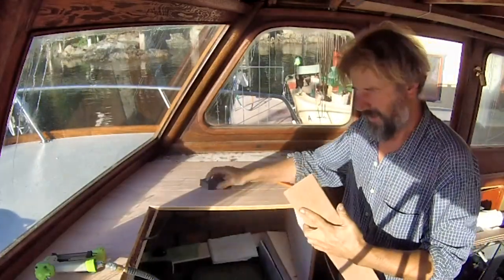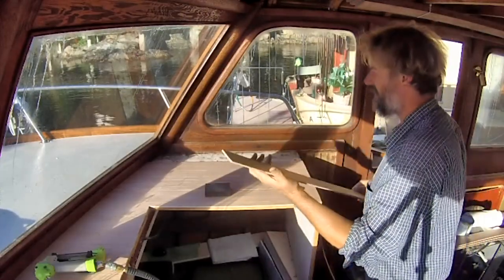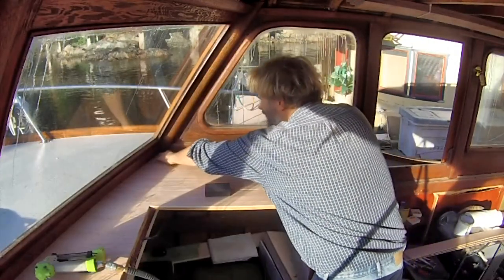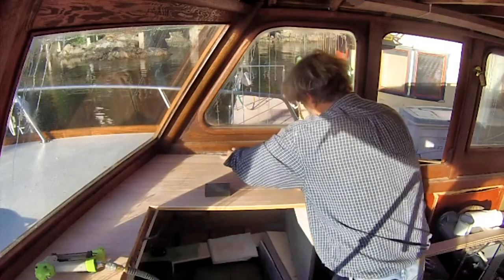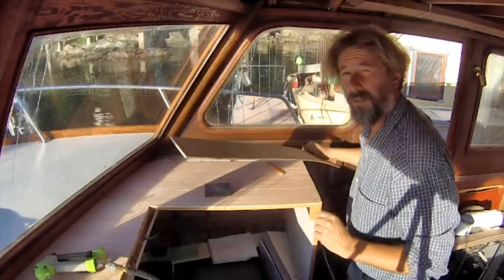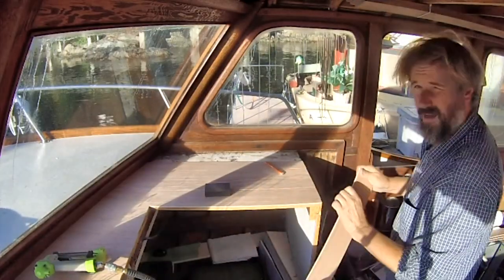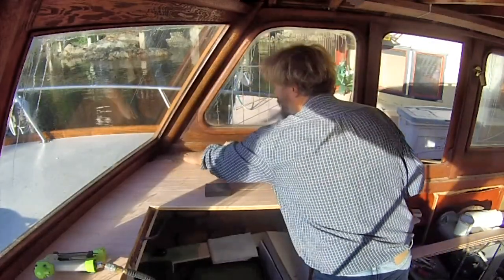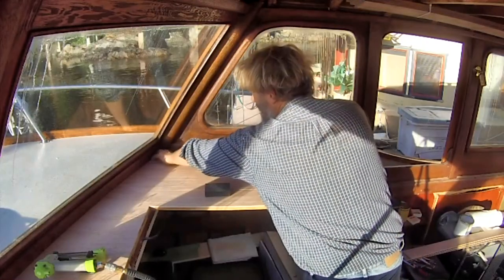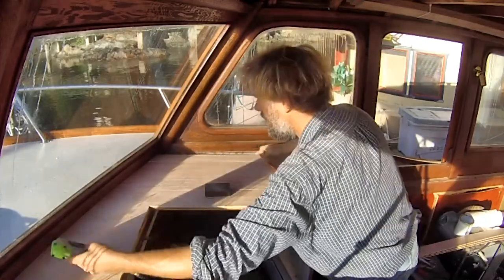This is going great. Here's how I've been putting these planks in — really pretty straightforward. Just clean up the inner end a little bit so it doesn't have fuzzies, slide it into place, mark it off for the cross cut, then disappear to the saw which is over here. And we're back. Make sure there are no burrs, lay it right down, and nail it in place — left-handed air nailing.